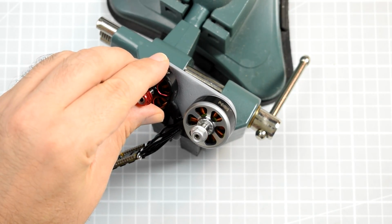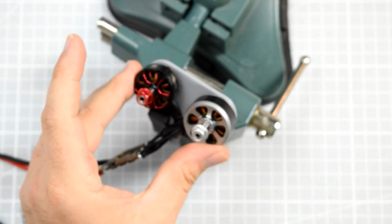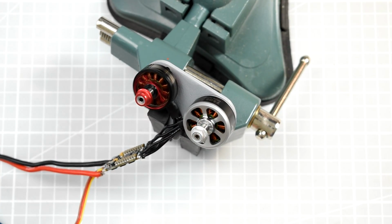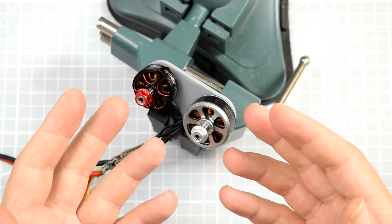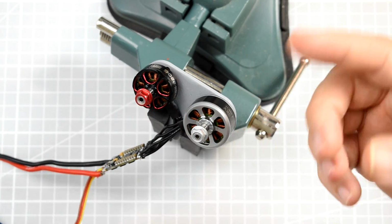Okay, and now let's... Oh, this one is getting hot. This one is getting hot, this one also is hot. All that stuttering and not rotating kind of kills the cooling on the motor, and as a result they really do seem to overheat. But if they start, they go. But definitely as soon as one of them stalls, stops, or anything happens and they go out of sync, it just starts to make a terrible noise and does not restart itself.